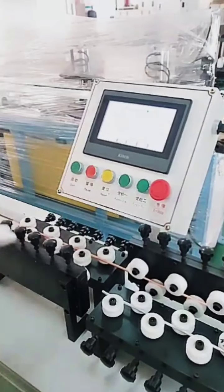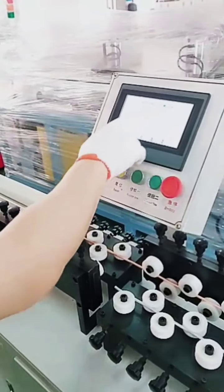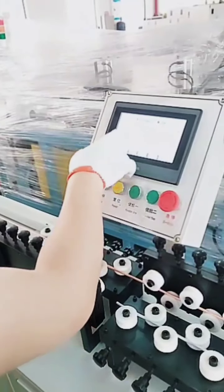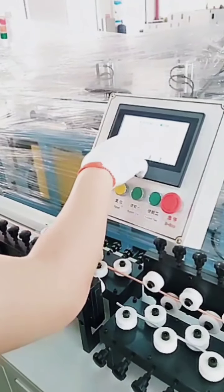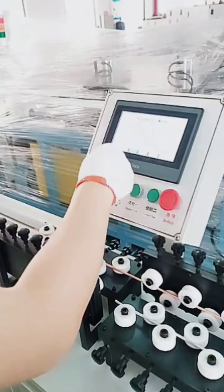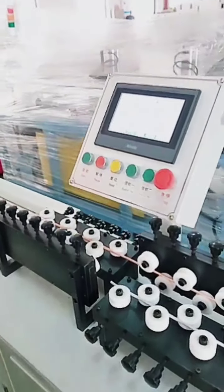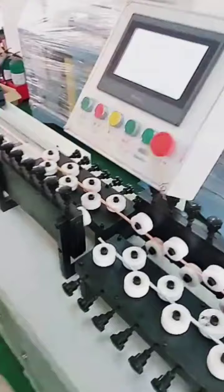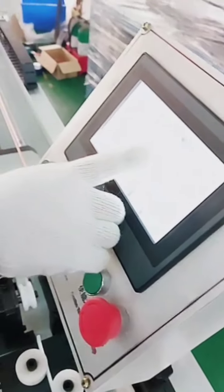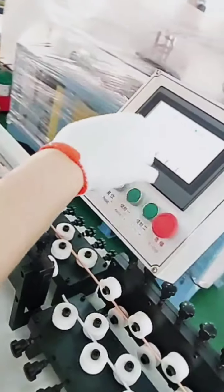So here we see number 1 feeding speed. Number one means the line 1 and line 2. So there is a feeding speed, output, feeding position, preset quantity, and tube length. Okay, let me explain to you one by one. First one, feeding speed means the speed of the feeding clamp moving. Output quantity means the tube quantity. You already got it.